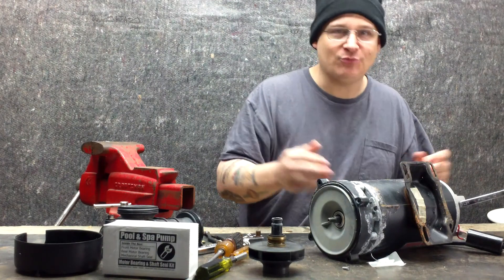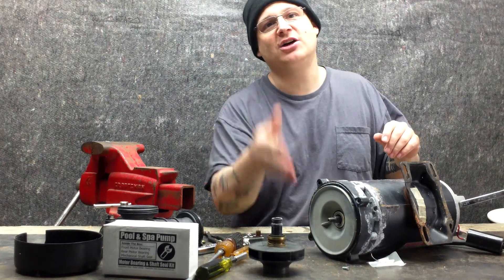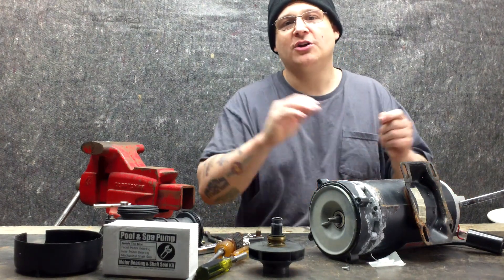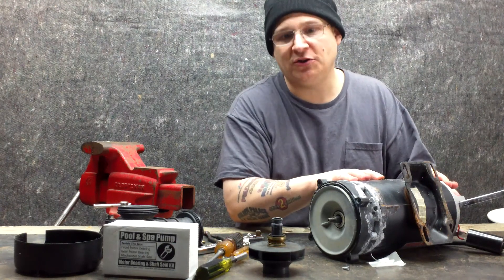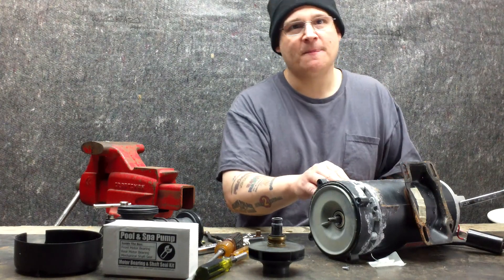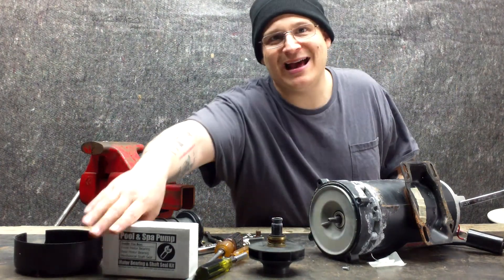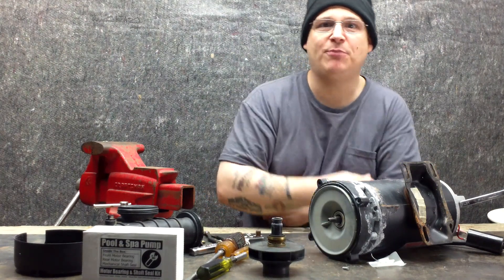This is part three of the Hydromax Pump. In part one, we showed you how to take apart the wet end. Part two, we showed you how to remove the impeller, which is part of the wet end. In part three, we're going to show you how to remove the stationary switch and the motor governor — you need to remove those to take out the shaft later on. In step four, how to remove the four through bolts and the seal housing. Step five, remove the end bells and the armature. Step six, change the bearings. Step seven, start putting it back together. All parts are available at wetheadpumprepair.com — the kit comes with bearings and seals to fix this pump and get it running again.